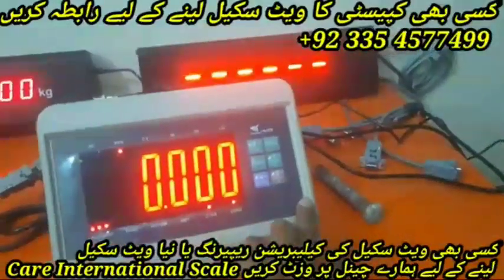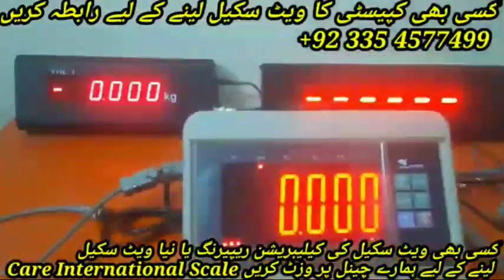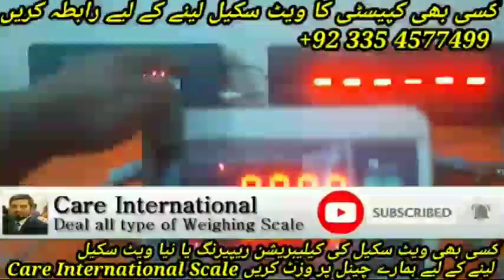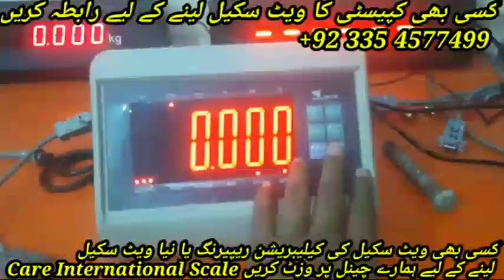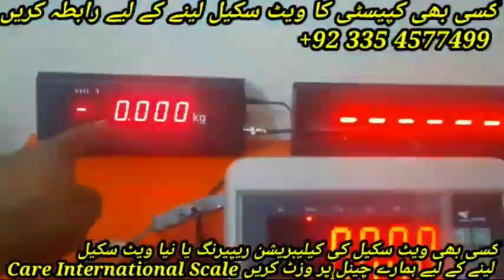The connection of the T7 indicator is on pins 3 and 5 — pin 3 is TX and pin 5 is Ground. The extender display connections will be on pins 2 and 5. For the setting, if you keep the baud rate at 2400, it will be connected. The extender display baud rate is set to 2400.